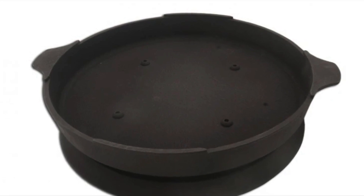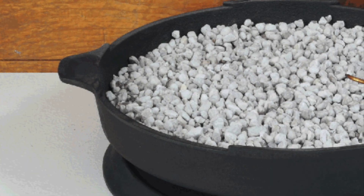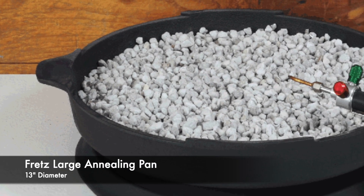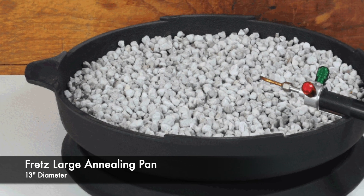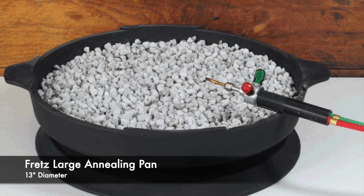Lastly, if you're working with large pieces or big coils of wire, consider an annealing pan. This is a thick metal dish filled with pumice — that's volcanic rock — and it allows you to get the flame all around the piece and heat it evenly. Quite often they rotate too, so they're very handy things.